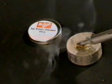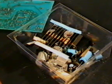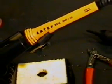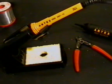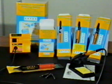To keep the tip in good condition, use tip tinner and cleaner, and remember to store all components in a clean, dry place. Use a modern soldering iron with a fine tip. This 25 watt Antex XS iron with a 2.3mm chisel tip is ideal for most PCB work. A complete range of Antex soldering irons and stations will be found in the catalogue section of this CD under the soldering equipment and accessories heading.